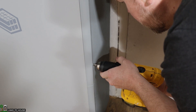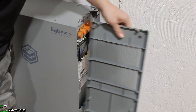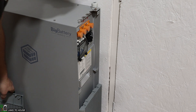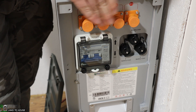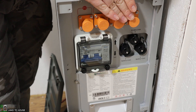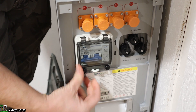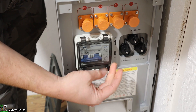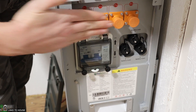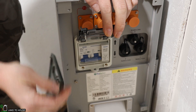There are four screws that hold the side cover in place, and once those are removed the cover just falls right off. This side of the battery has four different terminals for the positive cables — two of these will go to the inverter and two of these could be used to link another battery together. Down here is a breaker with a push tab; you have to loosen up the thumb screws first in order to access that breaker. This is a DC breaker for connecting the battery to the terminals. If I pull that open you can see that's where I'll flip it later to turn this unit on.